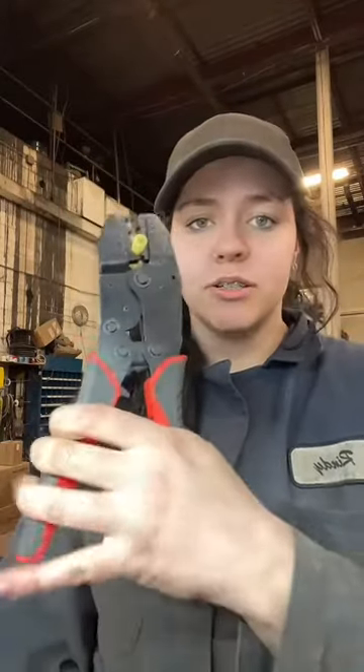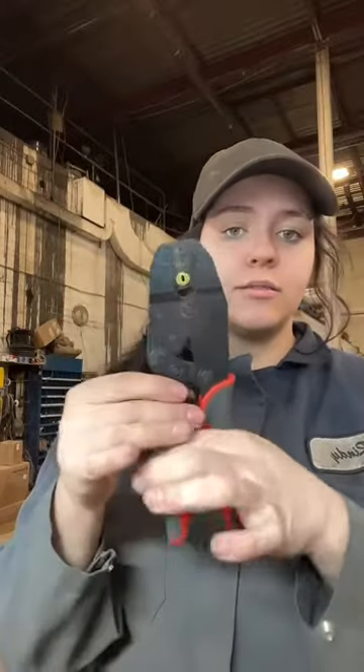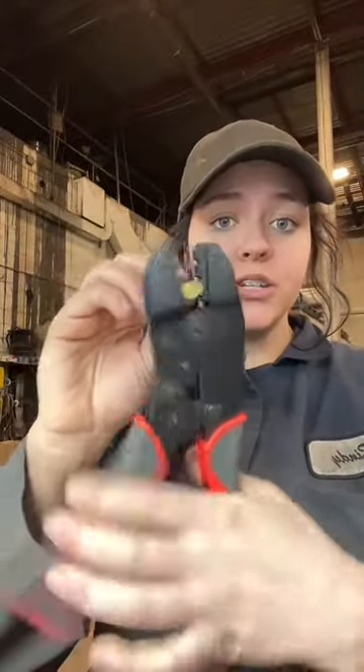This side is Olsa Tools and this side is a snap-on. I have really small hands, so this is really nice — being able to just squeeze it together. If I stop here, it doesn't open because it's not crimped all the way, so you have to force it all the way and finish your crimp. That's crimped. Let's plug this into what we need.